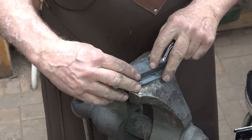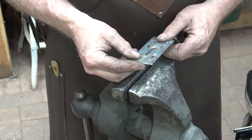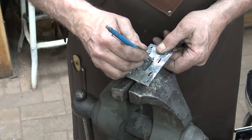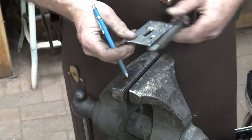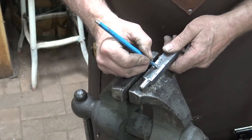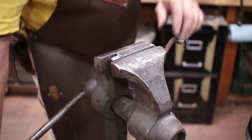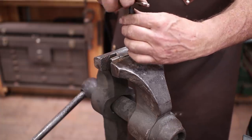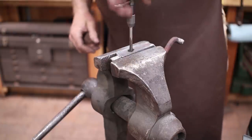I am going to need to drill a hole in here. I know that I want that to come that far back, so my hole has to be at least this far, and I want it to be able to come at least that far forward, so that same hole works perfect. I'll drill that centered for a quarter-twenty thread. We'll just go ahead and tap this — it's a number 7 drill bit for the quarter-twenty threads. It's one of the few I know by heart because I use it so often.